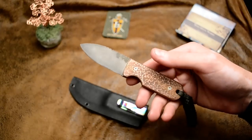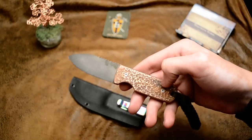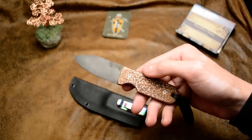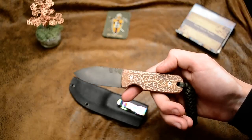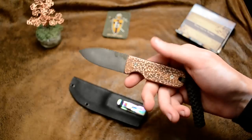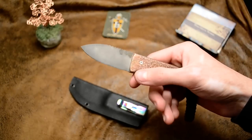What I did to the handles was: I hammered it, then I sandblasted it, then I put it in acid for a while, and then I heat colored it. I don't know if you can pick up the colors in this light, but there's a little blue and green in some places, but it's mostly a dull black, dull gray, some dull browns.